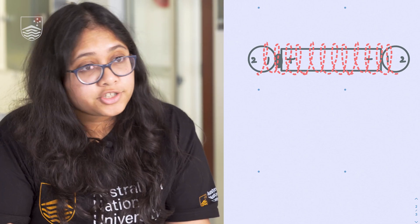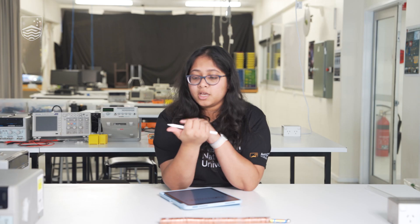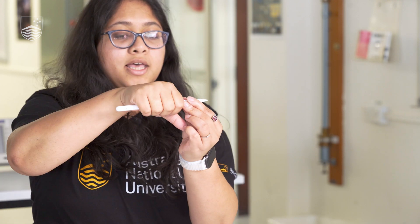When current flows through a conducting wire, it generates a magnetic field. You can find out the direction of this magnetic field by using the right-hand curl rule. All you need to do is orient your thumb towards the direction of the current — if the current is in this direction, then the direction of the magnetic field is shown by the curvature of your fingers. That is how you can determine the direction of the magnetic field resulting from a current-carrying wire.